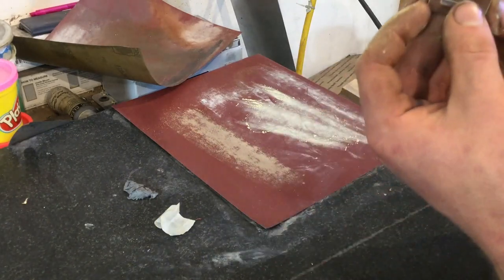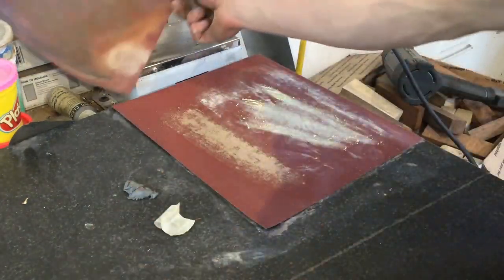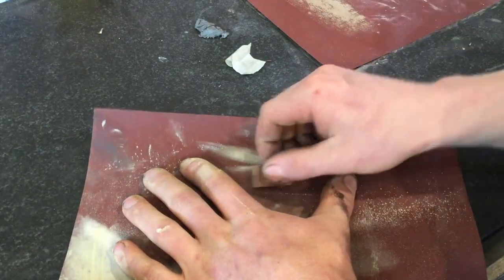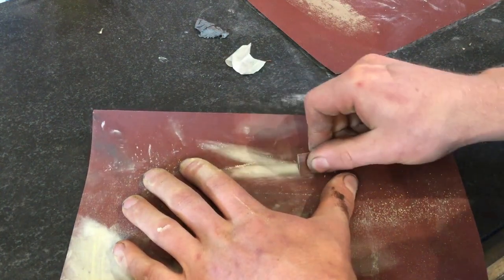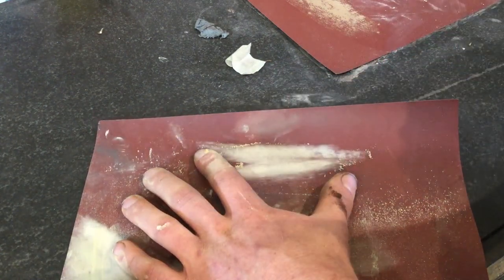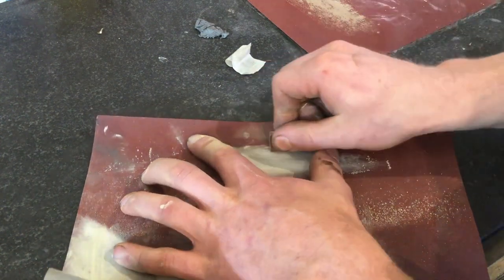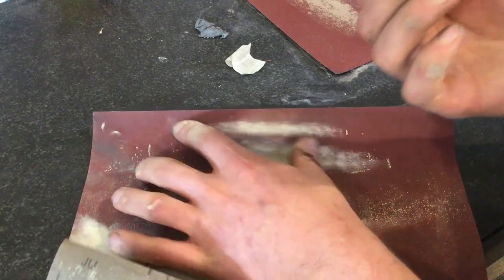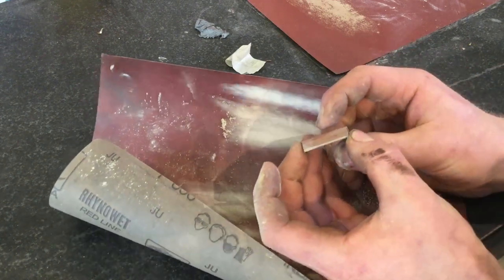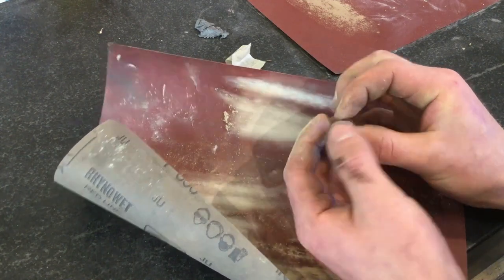And once you think you have it close, it can help to go to a finer grit. Curly 600 grit sandpaper. And I want to sand until all of the grinder and 220 grit lines are erased. The front of this bolster is going to be its final finish before we do any gluing. You see that the finer grit makes it easier to see whether this line is consistent.